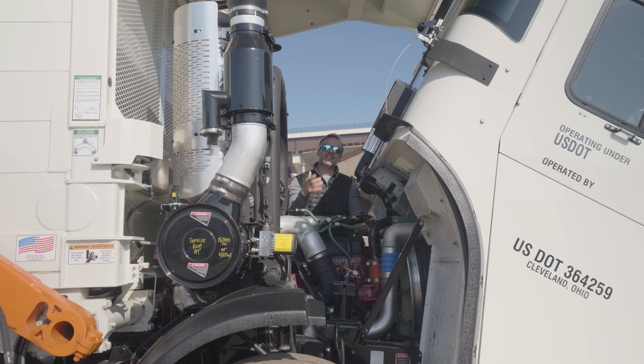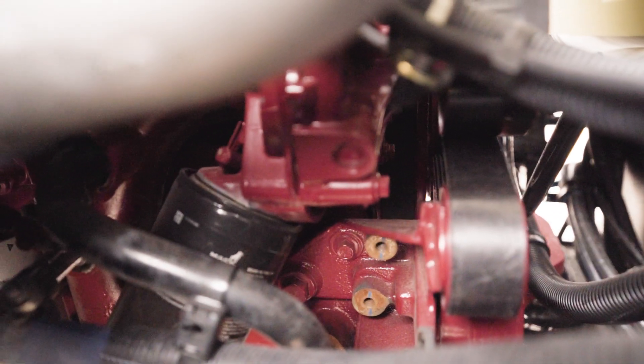Speaking of efficiency, this runs the Mack two-speed water pump, which I know sounds strange, but the principle behind this is quite amazing. In most cases, we're pushing against a thermostat — we're still trying to pump a ton of water, even when the engine's cool and doesn't need all that water moving around. With this, it decides whether it needs the low speed or the high speed. If you don't need that much cooling, you're going to be running the cooling pump at a lower speed. Therefore, it's going to be much more efficient. Those types of things add up to more than a two or three percent difference in terms of your fuel costs out on the road.